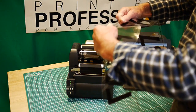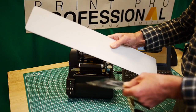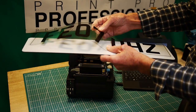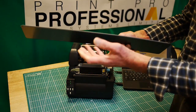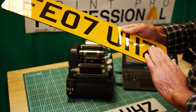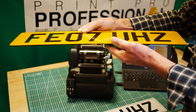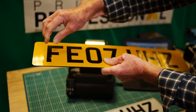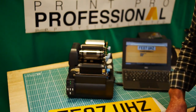I'll tear that one off because it's wrong. I then take my piece of ABS — whether I use yellow or white — and stick it down. You can see how nice the quality is; these are really lovely prints. It's printed on this side and then you lay it down into the plate. In my opinion, between using acrylic and using ABS, I would use ABS every time — it is a much nicer finish. And the other great thing about ABS is that because the registration is nicely on the surface, when you come to use 3D and 4D characters you can print the reg and then lay the characters exactly onto the printed surface. It's just a much nicer quality plate. I hope that's been of interest — thank you for your time.